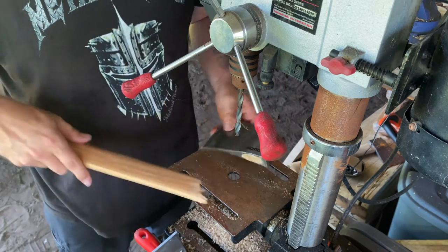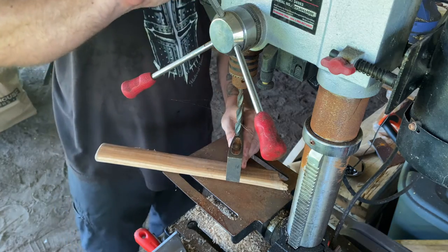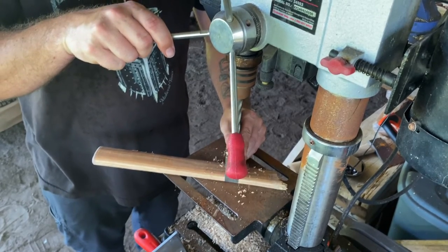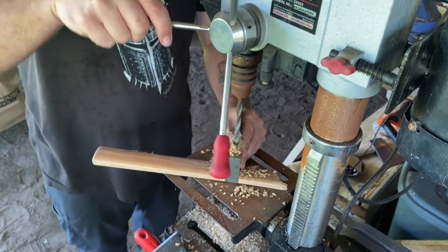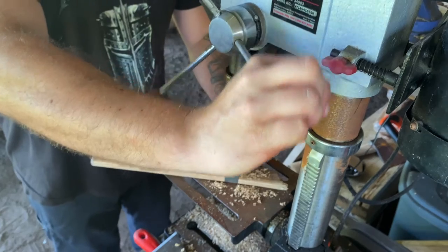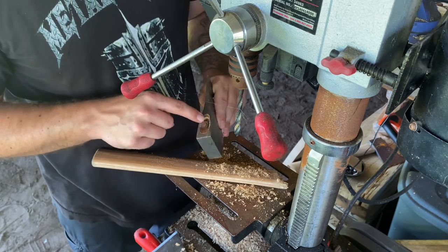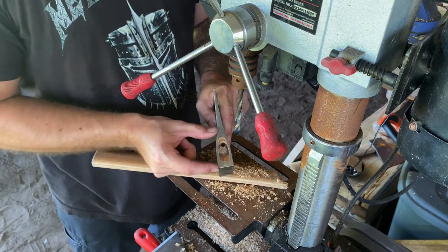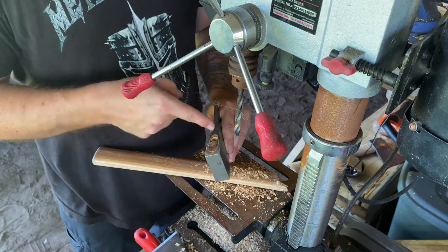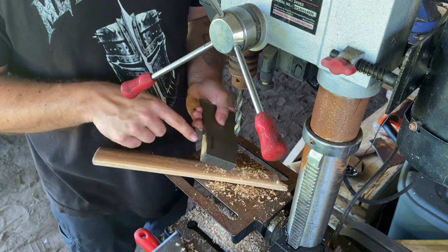Because of the axe curving like this, having something to set it on to give you a firm base is a very good idea. An important thing to note when you're drilling from the top: the way axes are designed, this eye narrows as it goes to the bottom. This side is smaller than the other side, so make sure you don't drill too close to the edge or you're going to mess up the inside of that eye with the drill bit. Just go slow. Also, I'm not drilling all the way through — I'm just drilling down into here.